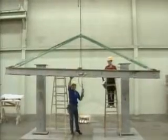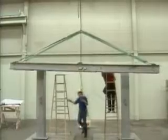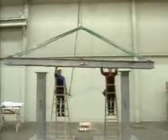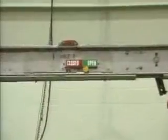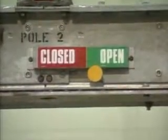Adjust the lower set of nuts to generally plumb and level the pedestal. Attach 4 lifting slings to the crossbase. Unbolt it from its skid and hoist it onto the mounting pedestals. Make sure the switch position indicator on the base is on the desired side. This will be the side on which the operator door will open. Loosely bolt the crossbase to the mounting pedestals, using the hardware called for on the drawing.